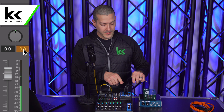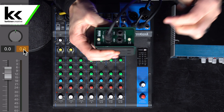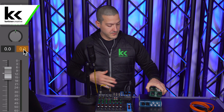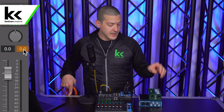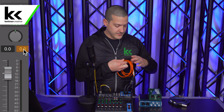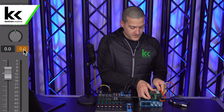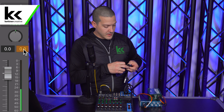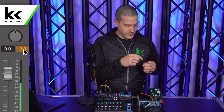So, unplug them from there — we're coming out of the audio mixer, then we're going to go into this DI box. On the left side here, we're going to go in the input, and on the right side here, we're going to go in the input. This will bring it down to a mic level, so now we can use an XLR cable because the XLR inputs on the Presonus AudioBox are mic level, and the quarter-inch are instrument level — and we're coming from line level. We're trying to come from line level, step it down with the DI box into mic level for the audio interface. Now we can connect the left output of the DI box to input one on the audio interface, and another XLR cable coming out of the right output of the DI box into the second input on the audio interface.